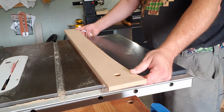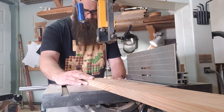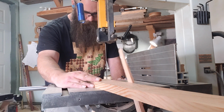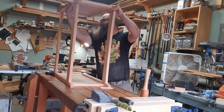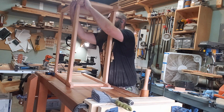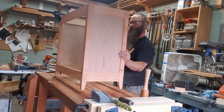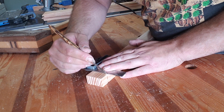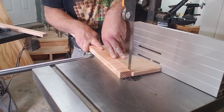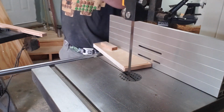And then I took an old template that I had from an old coffee table that looked like a nice curve, and I cut it into the front bottom rail because I like curvy rails. And then yet another dry assembly with those side assemblies together, front bottom rail, back, top, and bottom rails, and this is starting to look like a piece of furniture. And so now the drawer divider front pieces, the top one that goes into the top of the legs gets dovetailed.